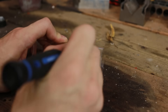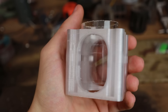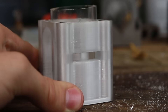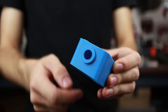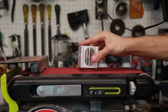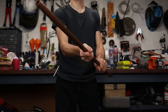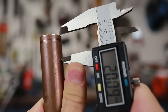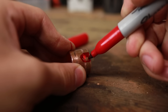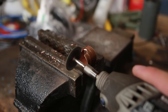My plan is to start by making a simple air engine. The first thing I need to do is cut this acrylic pipe to length, since it's going to become the cylinder sleeve. After cutting the pipe, I realized it would have made sense to cut the exhaust ports first before cutting it to length — but whatever works. As for the engine head, the first step is to cut threads for the ball valve to thread into using this half-inch tap. Once the thread is cut and I confirm the valve fits snugly, I smooth down the mating surfaces on both the head and the cylinder on my belt sander. To form the body of the valve, I'm going to use this length of copper pipe, scribing a line at the 20mm mark to cut it with the world's dullest pipe cutters. I marked out a mouse hole shape into the pipe — this is going to be where the air enters from. I found it easiest to drill it out first, then finish off the rest with a Dremel.